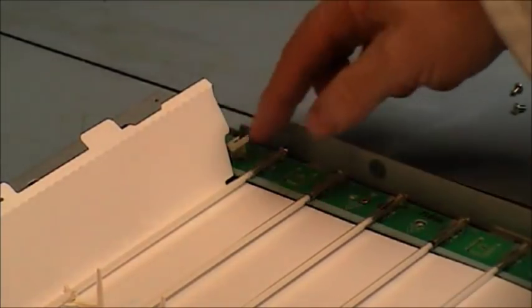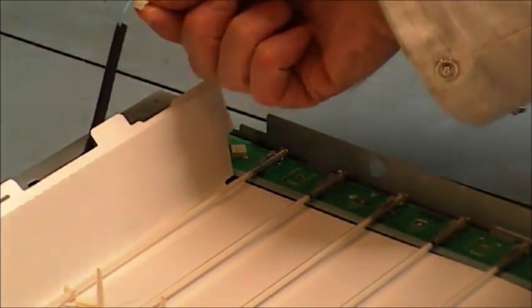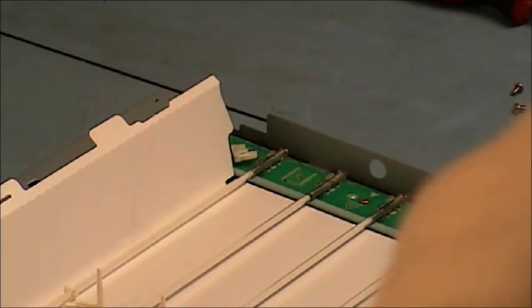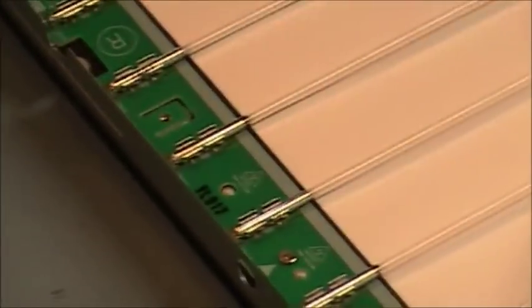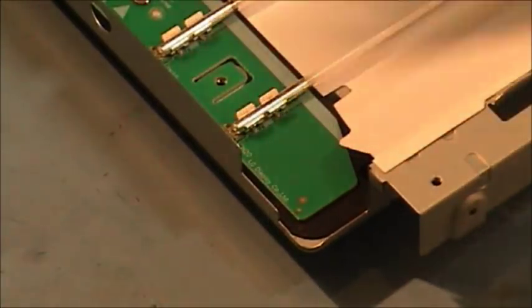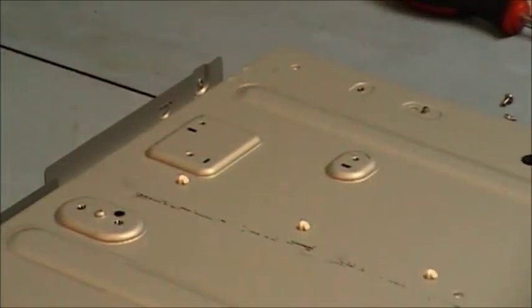What we have here is your high voltage comes in here, along this cable, and as you can see there's only one cable in it. That's your high voltage, and the other end of the transformer, on the output transformer of your inverter board, is on this, and that's connected to, let me see, let's get a shot. This is your earth end of your lamps, and if I just put my lead onto chassis, as you see we have a dead short there. So this end of these is at ground potential, while the other end is your high voltage end of your transformer. That's it really, that's all there is to stripping it down.